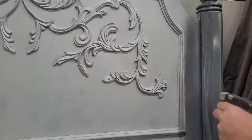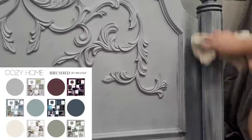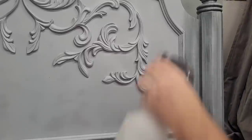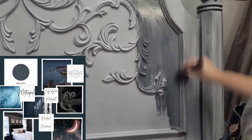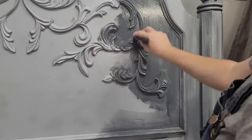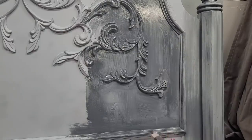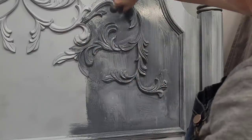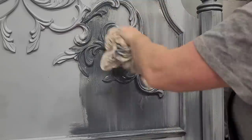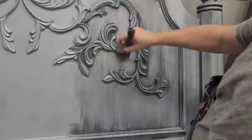Once I had my bonding primer on — I went through about two cans — I'm going to give this a color wash. This is one of my new custom colors from Daydream Apothecary paint, the Cozy Home Collection from Brushed by Brandy. This color is called Metropolis — it's a deep rich blue-gray. I'm doing the color wash over the top of my gray primer. A color wash is a very thin diluted layer of paint. I'm using a lot of water, and I spray it onto the surface then brush it in, and then wipe it with a rag using long, even, linear strokes.